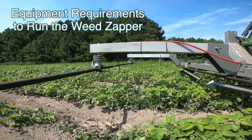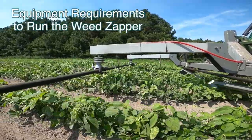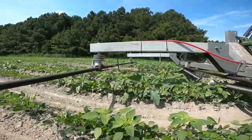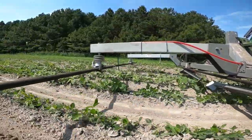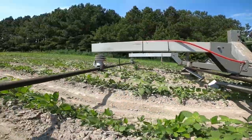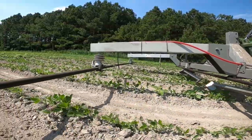Right now I'm using a 170 horsepower tractor and that seems to be the perfect size to run eight rows or 20 feet. It's not a whole lot of maintenance involved — just greasing a few grease fittings every 10 hours. There's a pretty big belt on the generator and you have to check the tension; eventually it'll need to be replaced. I've put about 200 hours on this machine so far and really haven't had to do anything to it. Fuel consumption is about a gallon and a half to two gallons per acre depending on weed pressure. The speed I operate at is generally about four miles per hour.